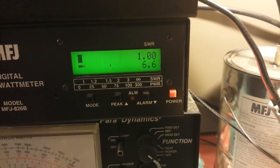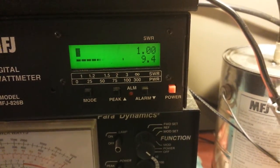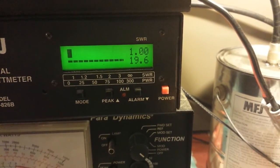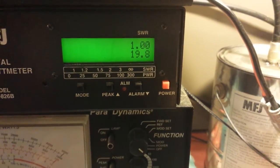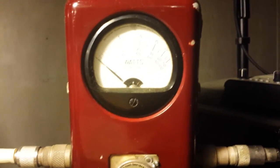Let's go ahead and show you what we're going to be putting into it from the bench radio. Got about 1.2 watts dead key. Audio testing. Alrighty — let me get that hot radio ready down there, let me turn that off. Picking up some feedback from there. All right, we're going to put about 20 watts into her. Let's flip on this power supply. We're going to be hitting it at 13.7 volts. Got our input right here — 10-watt slug in the reverse.